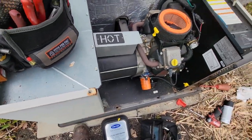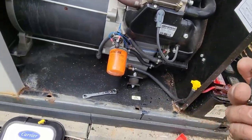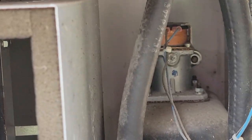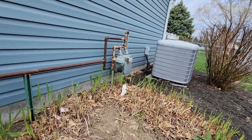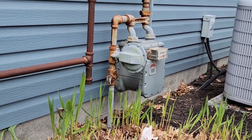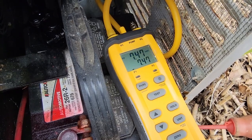Seven and a half inches - makes me think this has been a problem in the past, that really wouldn't surprise me. Like I was saying, I don't make these videos for homeowners - I make these for guys getting into the field, or those in HVAC who can't find an electrician that knows how to work on them. We're tapping in after the pressure regulator there. You can see the gas solenoid is right there. You can also go below that and I'm pretty sure that is my incoming pressure. You get too high and it won't open. With a medium pressure gas line and about a one-inch line running over here, we should have plenty of capacity. Seven and a half inches is pretty good - it should be firing.